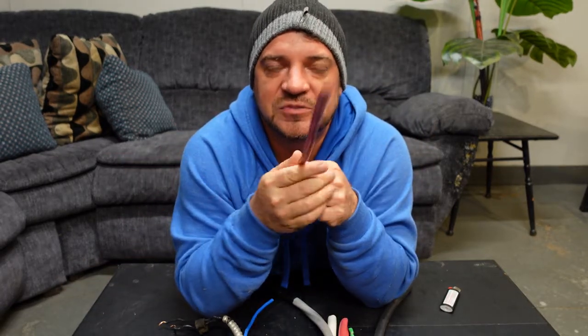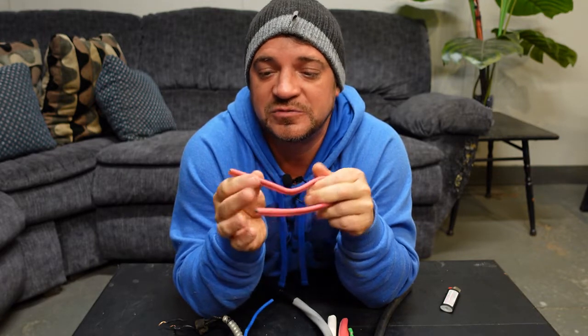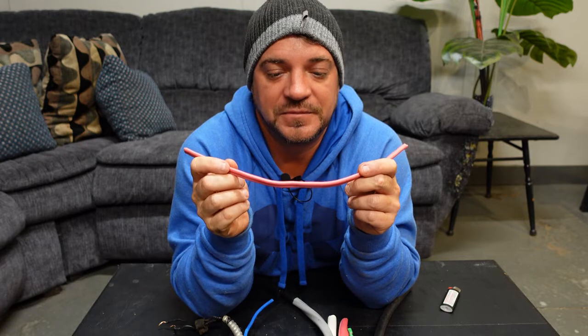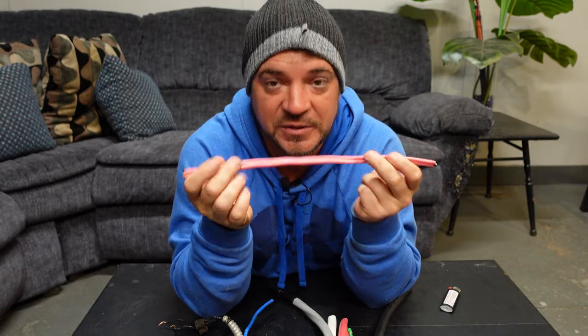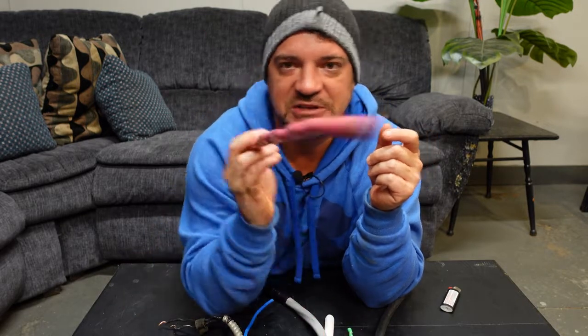Next is the heat-X wire, which is the red wire — specifically designed Romex or NMD. It has a black and a red conductor to indicate to electricians that it is 240-volt only. We do not typically use this for 120-volt wiring unless we're in a jam and tape it to indicate that, but that's considered dodgy electrical work. We use this 12-gauge wire for electric heating — electric baseboard heat, mini-split heat pump — anything to do with heat. It's good for 20 amps.